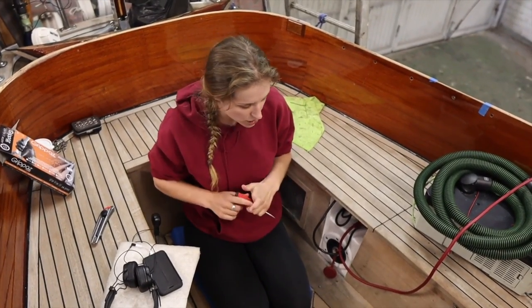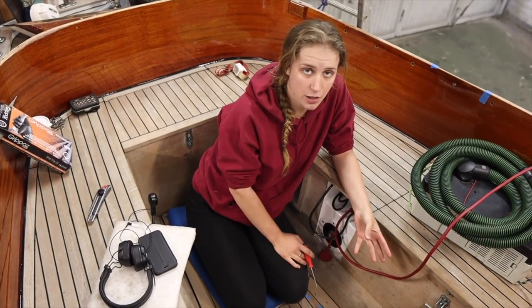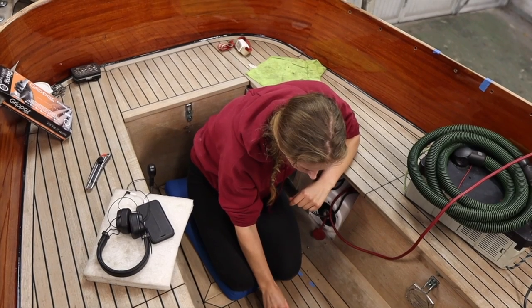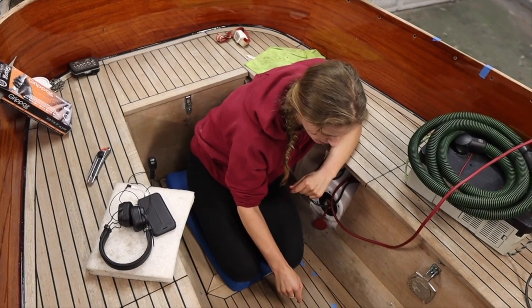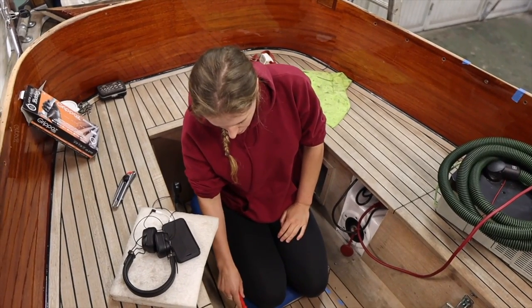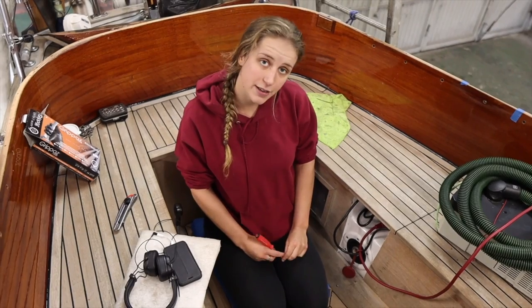There's always going to be a little bit of sealant left over — you can't cut it perfectly out. However, if you watched Aladino's video about this process, when he redid the seams he removed the rebate, which is a little thin slice of wood that basically spaces the planks apart. If you remove that, you've got a deeper seam, so I don't have to make the seams quite perfect. With a bit of sanding and a bit more dedication, it'll turn out.